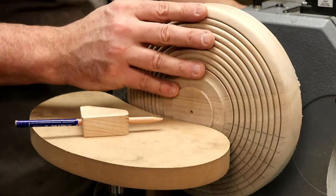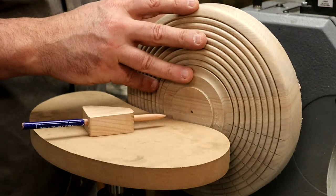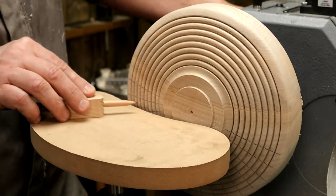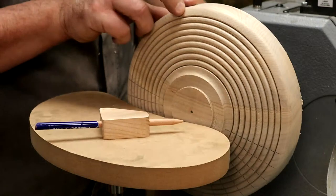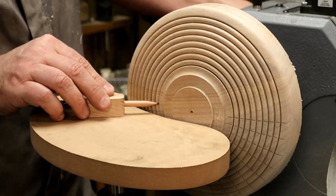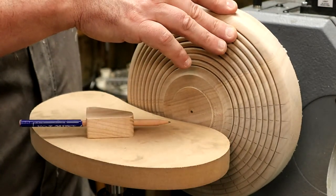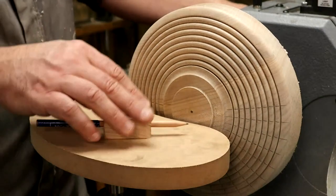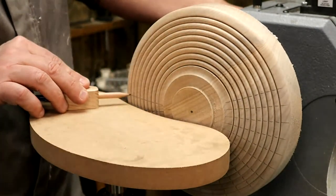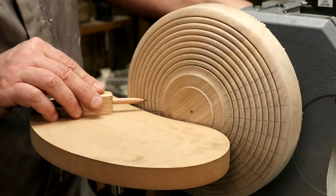And would this be possible? This is from Frederick. Would it be possible if you don't have indexing on the lathe? Frederick, then there are numerous things out there to put indexing on lathes, on chucks, you know, indexing plates, that sort of thing. Or go online and look and make your own up yourself. Bit of MDF, back of the chuck, for instance. Maybe that could be something we could look at as a future how-to, to create some simple indexing yourself.